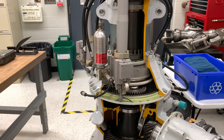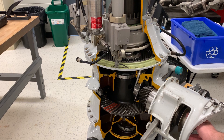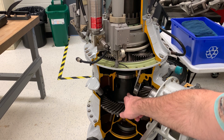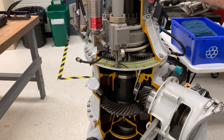Now let's take a closer look at how that happens. There's our input right here, which will be connected to the engine, and I can now spin the input pinion. That's going to output to the spiral bevel ring gear, and that's going to be connected to the shaft. The shaft comes up and turns a sun gear, which then turns the planetaries, connected to a planetary gear carrier. That planetary gear carrier then turns the mast.